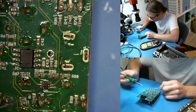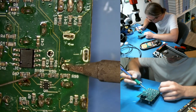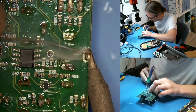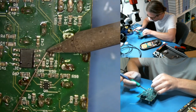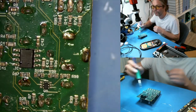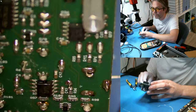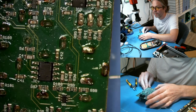I'm going to start with the resistor leg — just be quick with this because you don't want too much heat going down into the jack. Then I do the tip, and then a little bit of solder on the shield. You can test it before you solder the side pins in, but if you make a mistake you kind of have to start over. So those are all done up. Now we can trim that off. It looks pretty much like normal — there's lots of flux residue around but we'll clean that up in a second.